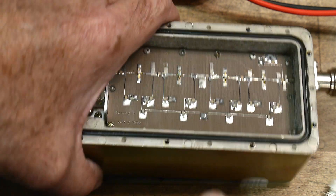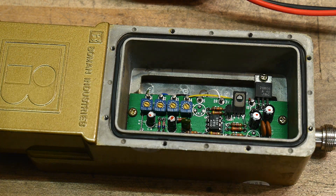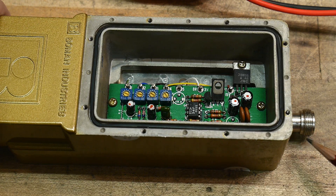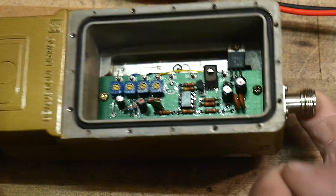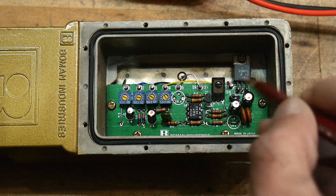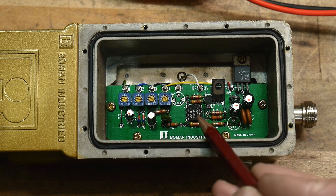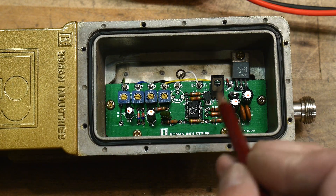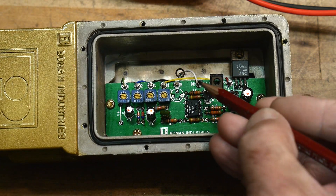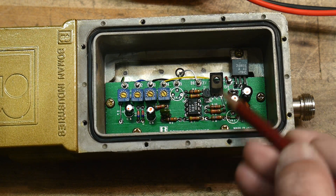The other side is the biasing network. These circuits run off a DC voltage that comes up the center of the coax. The board requires 15 volts. That 15 volts goes into a three-terminal regulator which outputs 6 volts. The 6 volts gets filtered and feeds a 555 timer chip, which oscillates at 9 kilohertz, generating an AC signal. That AC gets converted into a negative voltage. So we have a positive voltage in and a negative voltage out. The test point is marked 3 volts positive, and this circuit flips that to minus 3, giving plus or minus 3 volts for biasing.